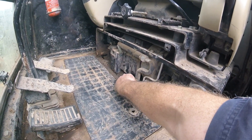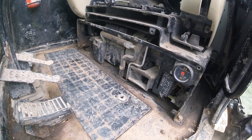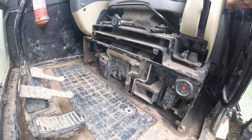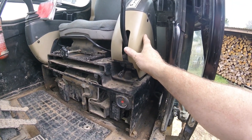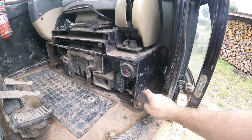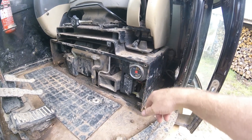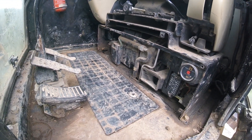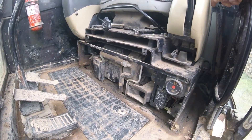Since fixing the wiring I've had no more issues, but it is intermittent so I'm hoping that was it. The other issue was a coolant leak — we were seeing a drip from around this area, from the cooling system. Within there is a heat exchanger. I'd got to the point where my next move was to start pulling the electrics out of both controllers and the hydraulic pipes, then lift this box off. Feeling like I was reaching the limits of my skills, I got a mechanic in and he agreed — it was a relatively quick and cheap fix once you got there, but getting there was a job and a half.